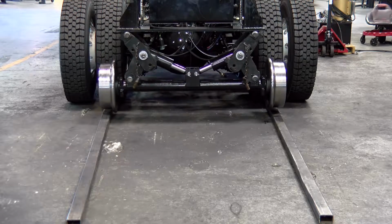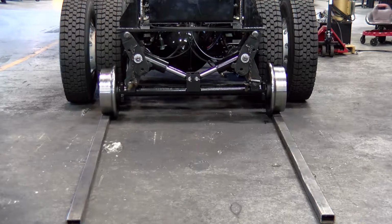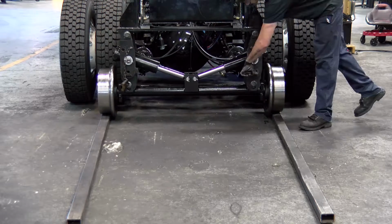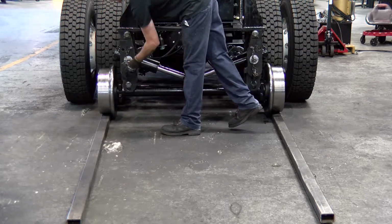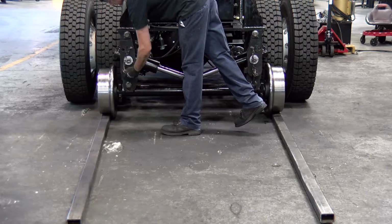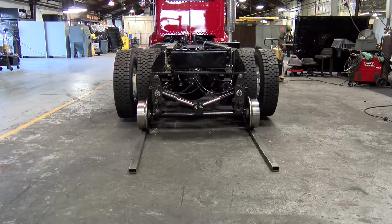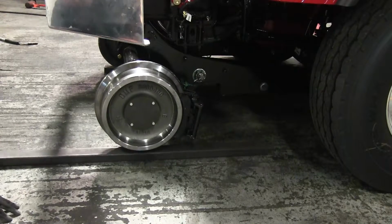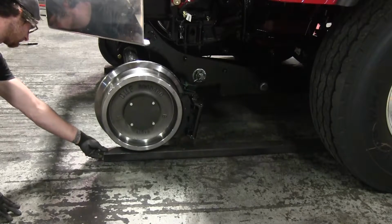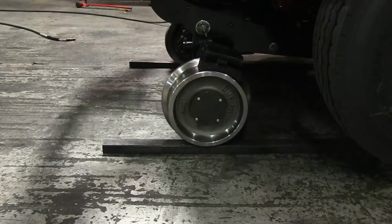Park the truck on straight and level track with the rail gear deployed and pinned off. If track is not available, park on level ground with 3-inch wide channel or tubing under the rail wheels and truck tires to simulate being on rail.